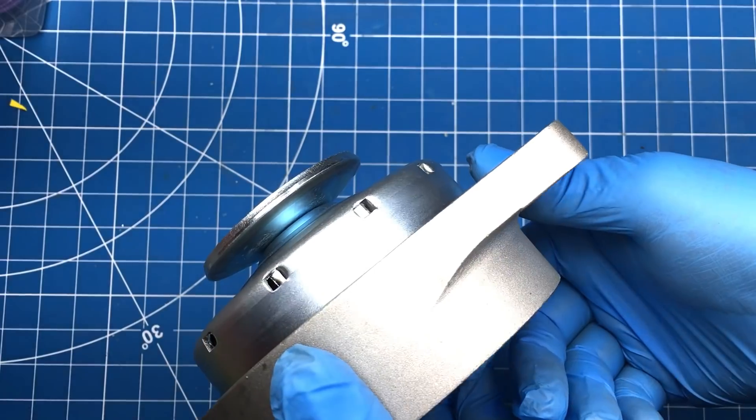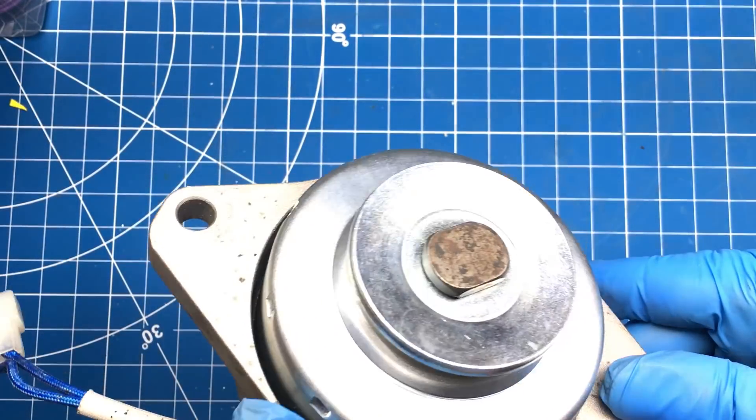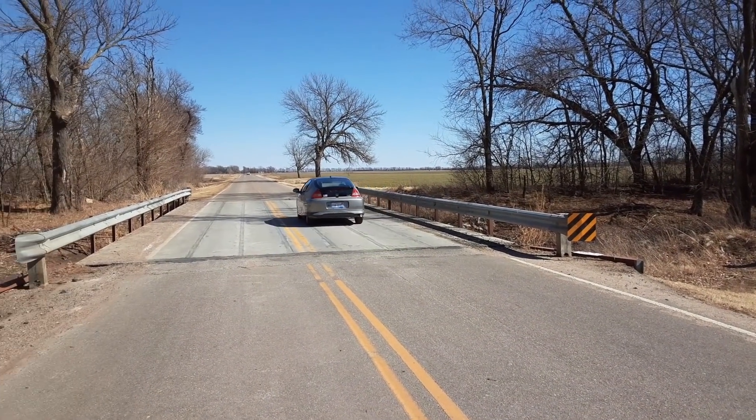When I spin the pulley, you can see how the alternator cogs — that's from the permanent magnets. The magnets replace the field windings, and that makes the alternator simple. But it also means the alternator needs to spin pretty fast to generate power. In other words, this alternator won't make power when the engine's at idle. The good part is the alternator won't drag down the engine at idle, and of course the bad part is it won't charge the battery. This car more or less has two speeds — idle and wide open throttle — and we don't spend a lot of time at idle.